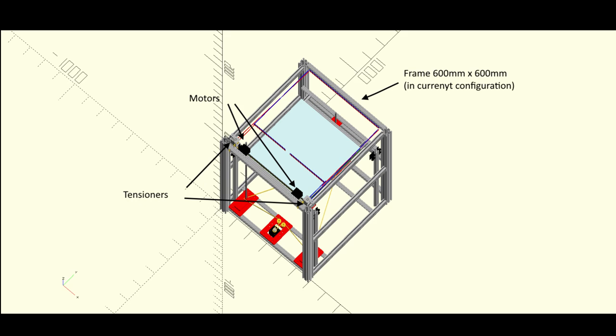The last picture shows the bigger picture. The frame as it stands is 600 by 600mm and I'll probably keep that. You can see how the remote pulley assembly fits within the overall frame. This arrangement will allow me to use more substantial bearings on the belt drive shaft, and the tension between the motor and the bottom pulley can be a lot less — as long as the belt doesn't slip and there's no slack. I should be able to keep the main belts tighter than one would normally do.